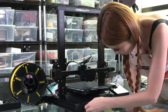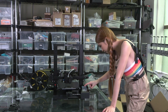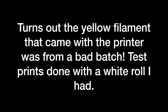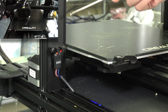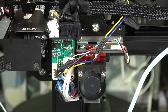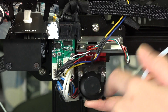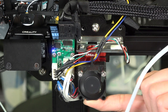Let's put it in and see what's on the card - let's try to print the 3D Benchy. As you can see we have an optical switch on our Z-axis, which means your first layer is going to be very accurate. I'm going to show you something really neat - I'm going to apply pressure on the nozzle. You see the blue light going on here? This is their auto-leveling system and it is using a strain gauge up here. It's very unusual, very cool.